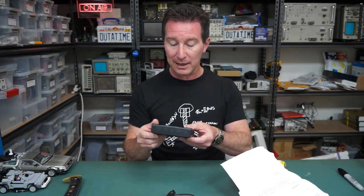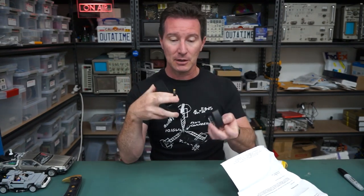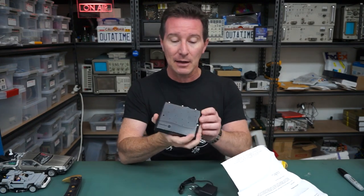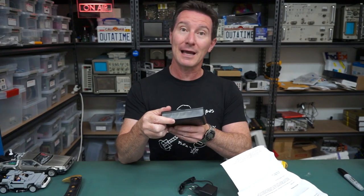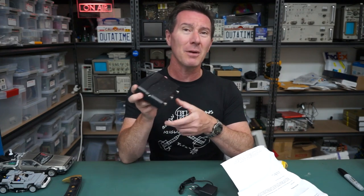Obviously gone. It's probably just a splitter, which is basically some resistors in a box. That's pretty much all it's going to be, I suspect. But let's tear it down. No, it's going to inject the phantom voltage. Not phantom, but, yeah, it is. Going to inject the voltage for the amplifier, the masthead amplifier. And it's probably got an inductor in series with it and an AC coupling cap, but probably not much else.